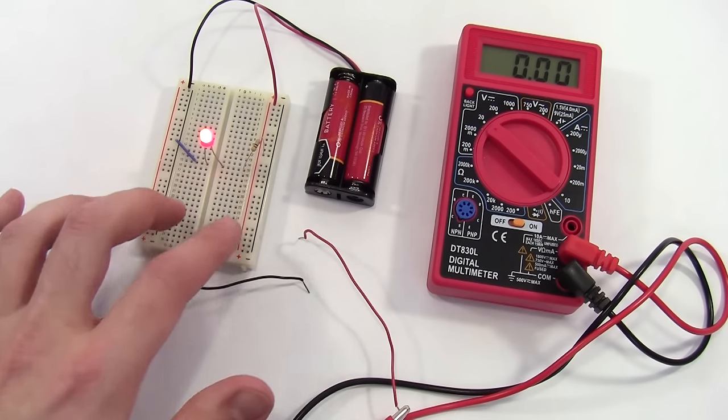With cheaper multimeters, you won't get very accurate readings for very small resistances. If you're trying to measure something like a wire — usually around one ohm or less — don't trust those readings too much. Going down to the smallest range on a wire, I get something like 1.0 ohms, but really below an ohm your reading won't be very accurate with a cheap multimeter. Use this to measure actual resistors, not just pieces of conductive metal or wires.